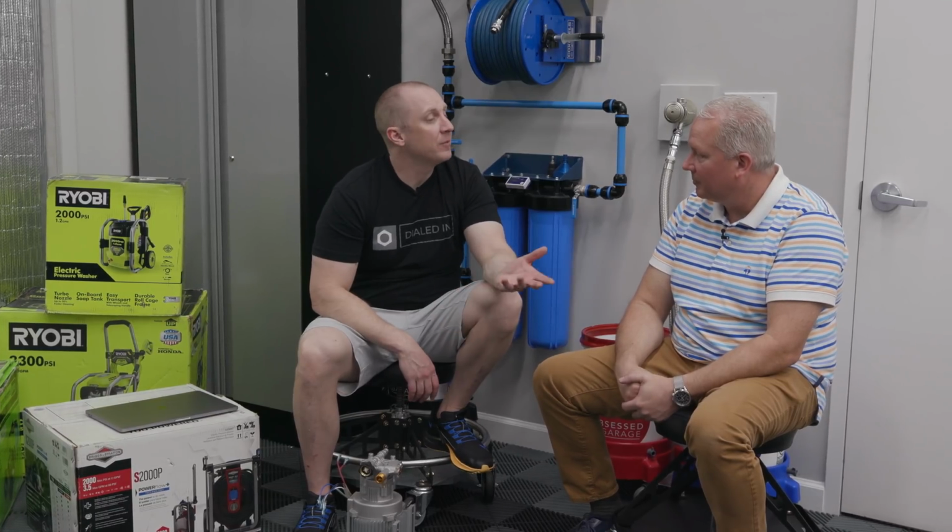So when I go to like a big commercial pressure washer or commercial car wash, are they targeting flow or pressure? What are they generally setting those at? Generally they're around 700 psi. Really? So I think you're kind of right on when you're saying keep it around 1,000 or less, right? Because our little electric pressure washers, there's a give and take there, right? Those pressure washers that a lot of car washes are using do 3, 4, 5 gallons per minute. Sure, right, and they're using huge, commercial grade triplex pumps with giant, at least 240 volt, 30, 40, 50 amp pumps. Right, exactly. Yeah.